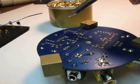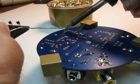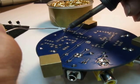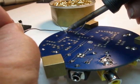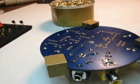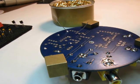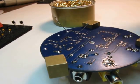This is why you see me moving the board all around, because I want to get the iron so I can get the pad and the lead at the same time in that puddle. When I put it in the puddle, I just wait a second. Now I can add solder. And you notice I didn't add it to the iron, I added it to the pad or the lead, and it immediately melted, so I know the heat flowed from the iron and heated everything up.